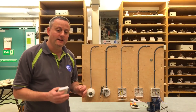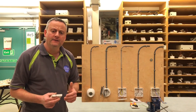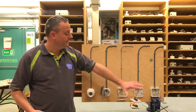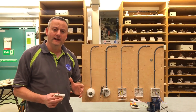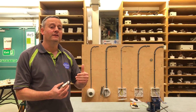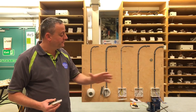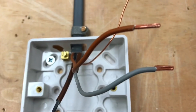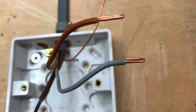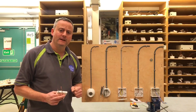In this video presentation we're going to take our skills from terminating light switches, which is very early on in the learning we're doing at Tresham College, and adapt them slightly in order to connect a BS1363 socket outlet. The problem with my learners is that they don't terminate the conductors correctly into the back of the socket outlet — they use the skills they'd previously only just learned on a light switch.